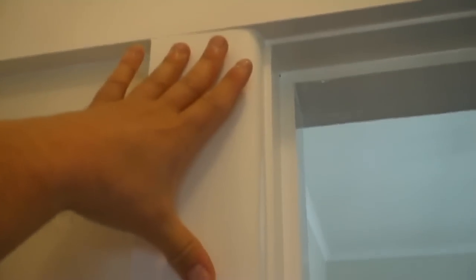go around and move in sections of maybe 20 centimeters like this. So about 20 centimeters, cut in, bring it around, paint it here, bring it around, paint it here, bring it around, paint it here, and if you want, you can wipe this face off, okay? I didn't wipe it off, I just spread it out to make sure that it's not going to leave a very thick layer, so it's not going to show, and it's not showing, so it's not really necessary to wipe it off, but you can if you want to be very careful.